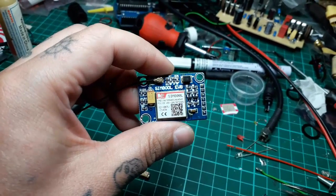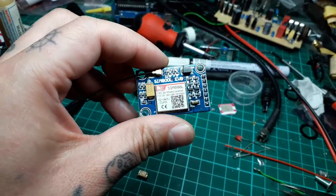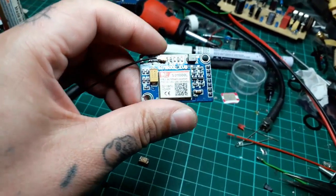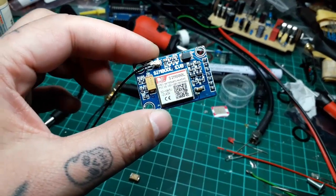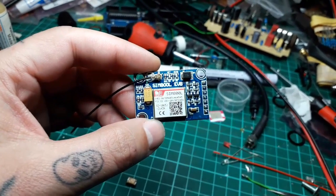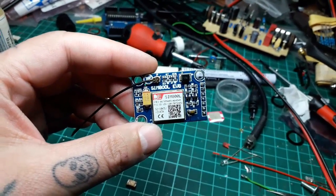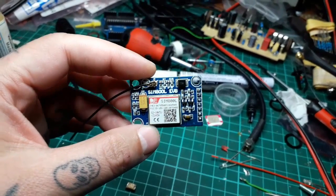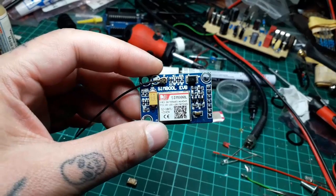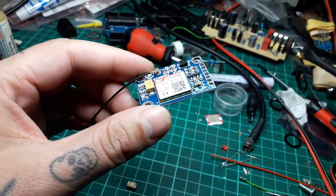The final product will wake up every two hours, send data, and then go back to deep sleep — around 10 microamps. Anyway, the problem with those modules persisted even after fixing the registration issues. I don't have a GSM protocol analyzer or an oscilloscope that can reach those frequencies to actually analyze what's happening at that particular moment.